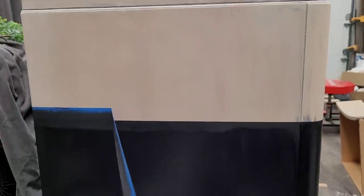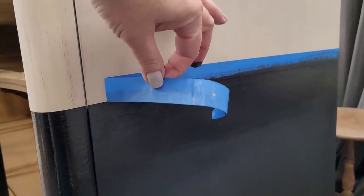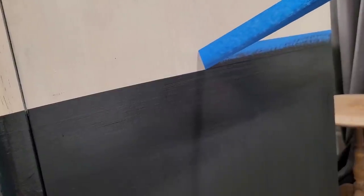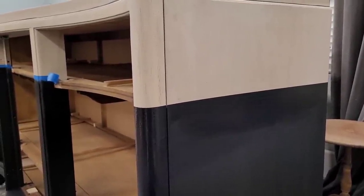I pull my tape while my final coat of paint is still nice and wet, because I don't want it to have a tendency to pull the paint with it. While the paint is wet it's soft and it'll pull away with the tape without tearing or ripping unevenly. This was a new paint for me and at first I did struggle to get it brush-stroke free. I found that a soft synthetic bristle brush, using water with it, and sanding in between coats was the way to get it brush-stroke free — but it did take a little bit of practice.